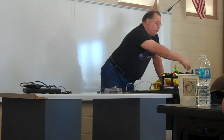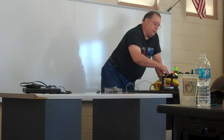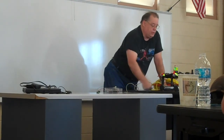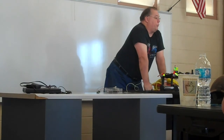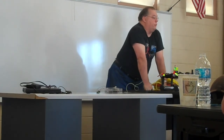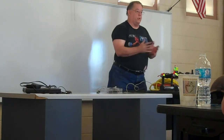Because I have much larger tubes, it is sealed all the way up to here. There are bulkhead fittings inside here that I made. And this whole chamber here produced enough buoyancy, even with the batteries attached. But I had to attach quite a bit of lead to the front in order to get it neutrally buoyant. Which is nice because it's much easier to adjust for neutral buoyancy by adding weight than by adding a non-crushable flotation in small increments.